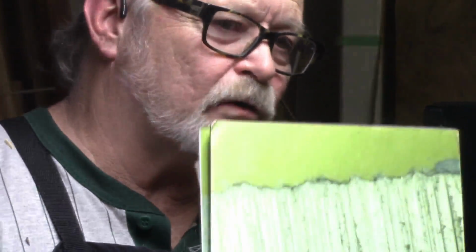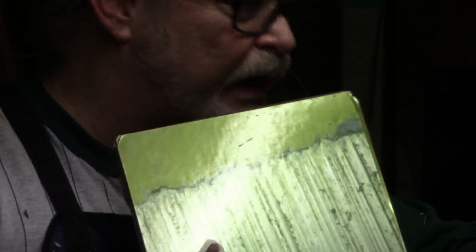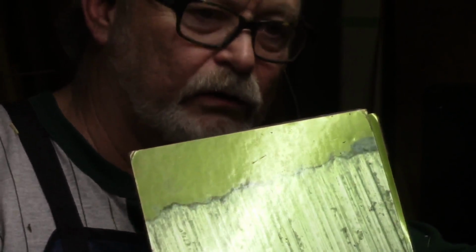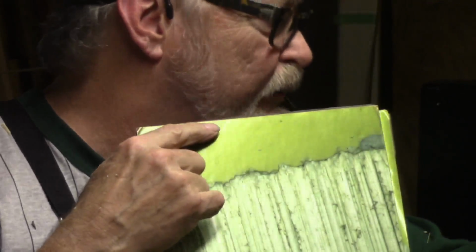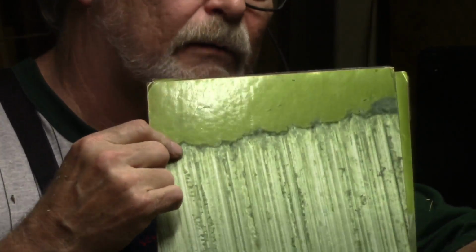And so they had heard stories too, and I've had professionals tell me that some of the tools like Jerry Glaser developed, you can't get them sharp. You can't get them as sharp. So they had me do a whole series of studies with gouges and skews, and then later with scrapers, believe it or not. What they had me do was prepare an edge and cut the wood with those different prepared edges and in different steels. So this is a skew chisel, what it looks like off a grinder at 200x.